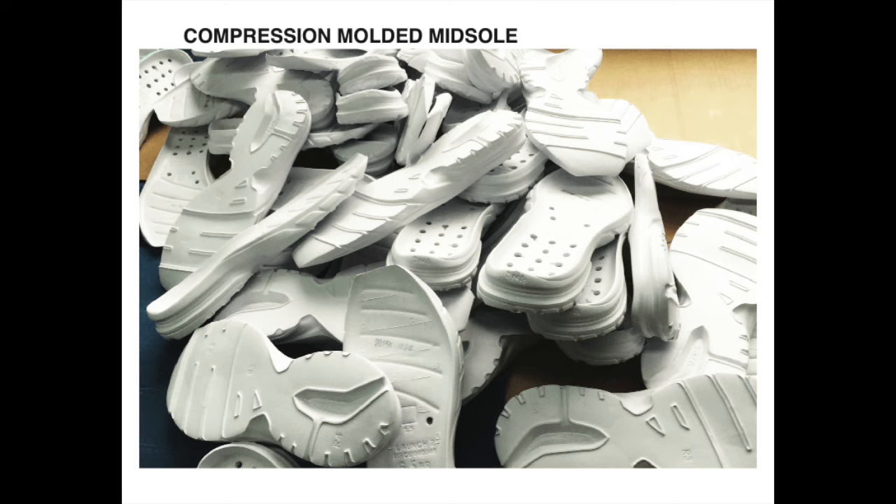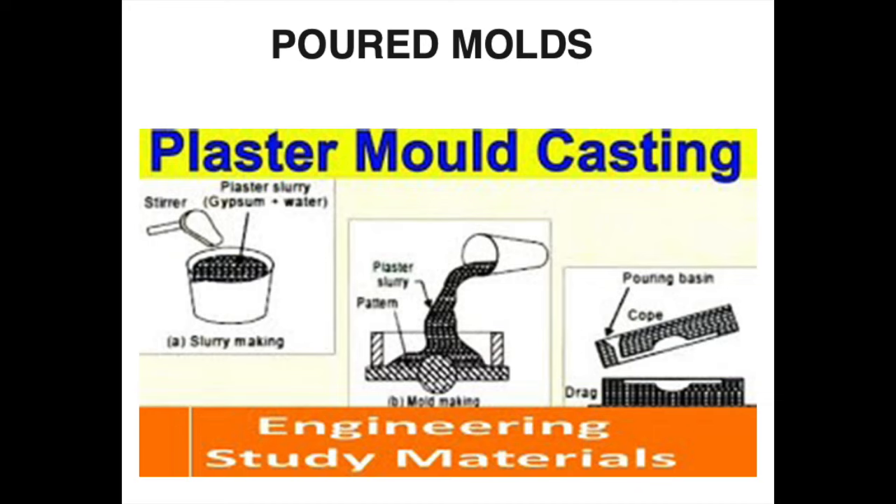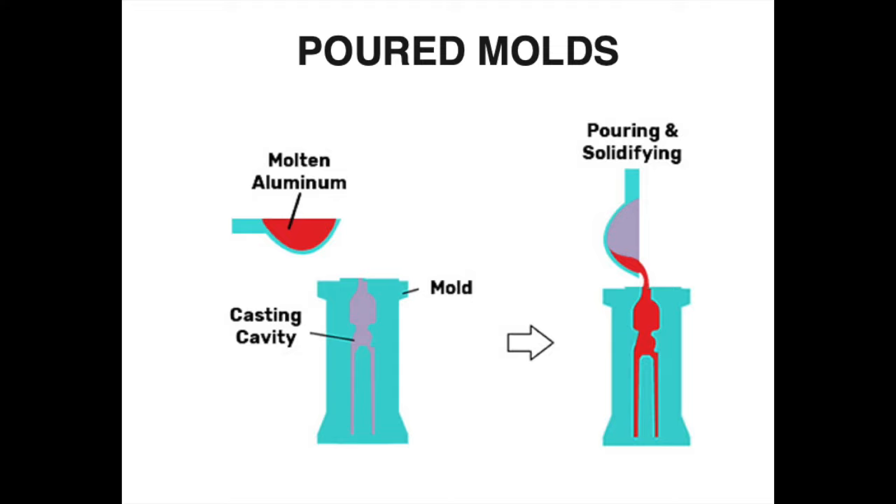In the same type of steel molds, you actually have different types of poured molds. That waffle iron is technically a poured mold — you pour the batter into the steel mold, you close the lid, and you let it finish its chemical process. In the case of materials like EVA or PU, it actually just dries and chemically sets, then you open it up and you get your mold. Injection molding is another type of poured mold technically, because the material was a liquid when injected into the molds. I was always taught that with an injection mold, when you put it into the mold they're tiny — proportionately smaller than they actually are when done. When you pull them out of the molds, they pop and expand rapidly but hold the shape they were in when molded. For the most part, most midsoles and outsoles are compression molded.